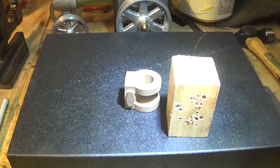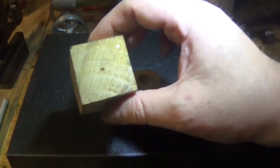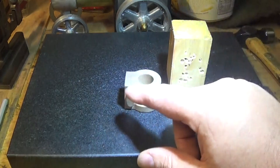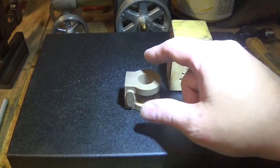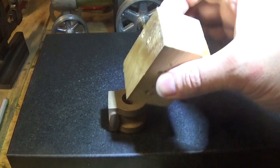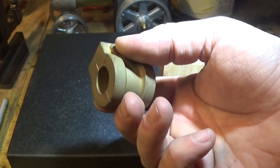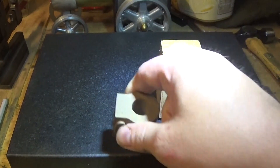It's really not all that difficult. The best way is to make a plug out of a piece of wood — it doesn't matter much what it is. I'm going to use this and just plug this, basically by putting it in the lathe and turning it down until it's a pretty good tight fit on there, and chopping it off with a hacksaw afterwards. So that's what I'm going to do.